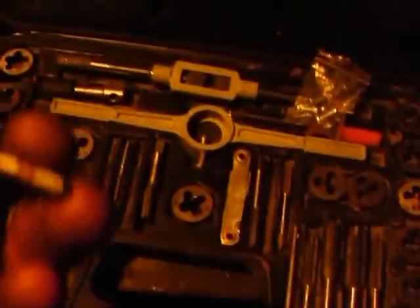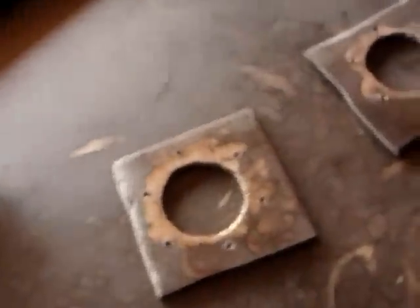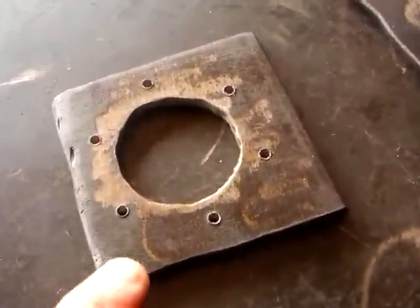and use the little tools to figure out the size of the thread or the space in between the threads on the screws, and then use that and match it to the size tap, and it turned out to be 10-32. This little apparatus is bust, so I've clamped it with these clamp grips, mole grips. Now I'm working the threads in. We can see the precision machining in better light. The holes tapped.